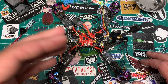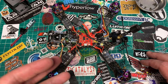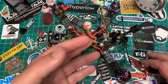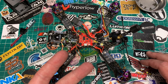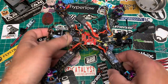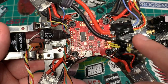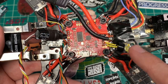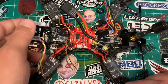I recommend you get a board that has the ability to do your SBUS and your smart audio — those are the two basics. If I've got two UARTs, one for SBUS and one for smart audio, that's minimum — I'm good with that. This board has five total UARTs, so we're going to do ESC telemetry, smart audio, smart port telemetry, SBUS, and UART camera control. That gives us all the ability we need.